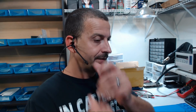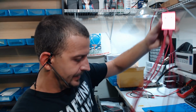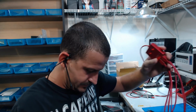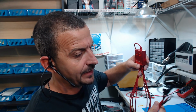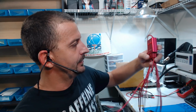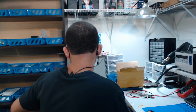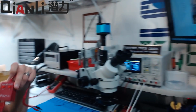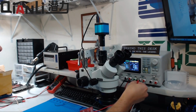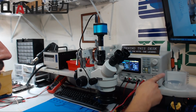So we're going to use the thing that came in that box, but I'm going to go ahead and use one of my old leads here. I'm going to pick a phone. Let's grab an iPhone 6S here, okay? That would be this lead here. I'm going to throw the rest of this aside. Okay, I'm going to connect the iPhone 6S to this thingy, and we're going to plug this into the supply. Okay, my supply is set at 4 volts, 3.2 amps.